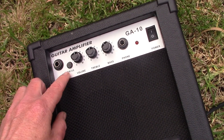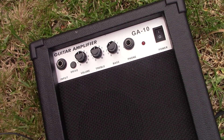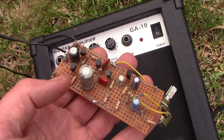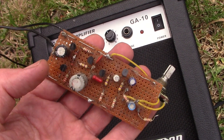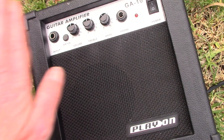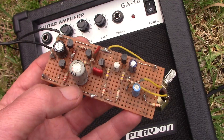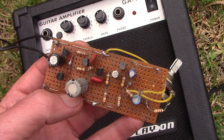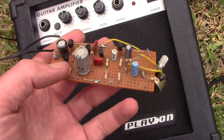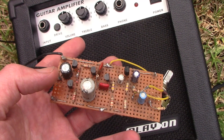When you press the drive button it brings the levels up with even more distortion. Here's a simple transistor amplifier — probably not quite as loud as the guitar amplifier, but it sounds very good. So what I'm going to do is rip out the original amplifier. I'll keep the speaker, the box, and the power supply, but hopefully we'll get better audio from this discrete component amplifier. Also, as I'm not drawing as much current, there should be less strain on the power supply, so that's another source of distortion removed.